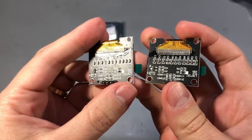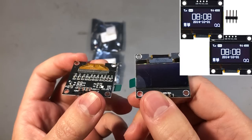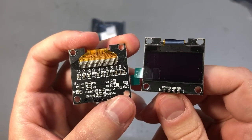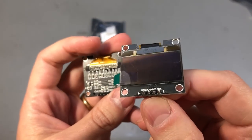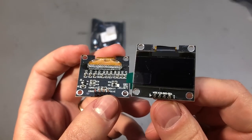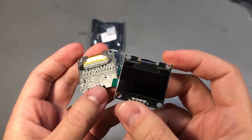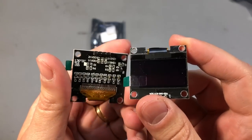Next I have a couple of simple white OLED screens based on the SSD1306 controller, 128x64 pixels, with an I2C interface — although the controller is capable of SPI, this breakout board only brings out I2C. These are 1.3-inch displays, slightly bigger than the usual 0.9 or 1-inch sizes, which makes them easier to see but also a little more expensive and harder to find. I tend to use these whenever I build prototypes that need a screen to share information with the user.